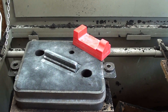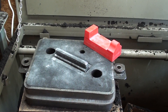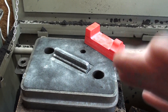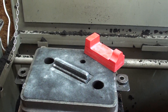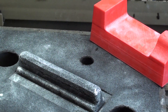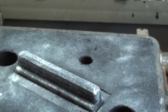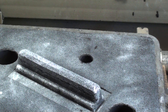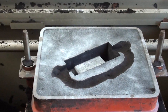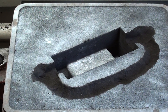I ought to run for Congress and do nothing up on the hill, just as our illustrious elected officials do. Well, this is the mold that I made yesterday, and again, this is the 10x12 flask — much lighter in weight and easier to handle. Look at how nice that part withdrew from this pattern — it pulled right out. I was extremely pleased with that. Here's the other half: got the gate in it, the risers, the sprue of course, and I blew that out real good. I think it's going to pour all right.